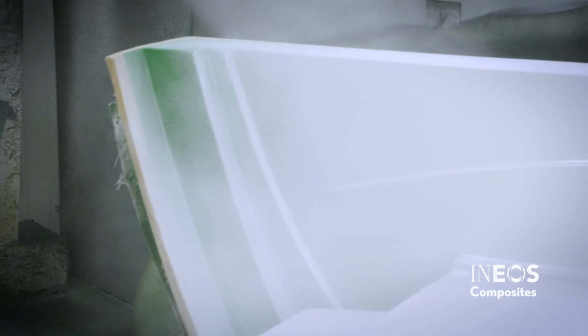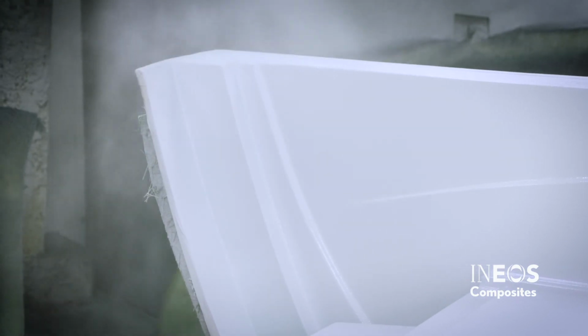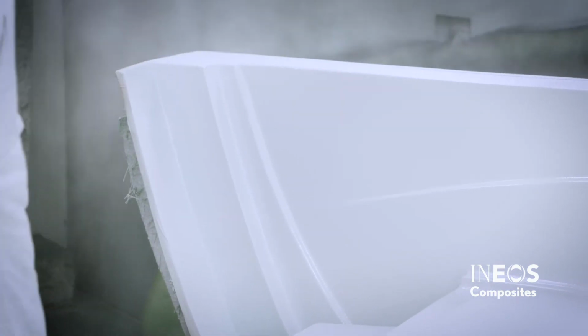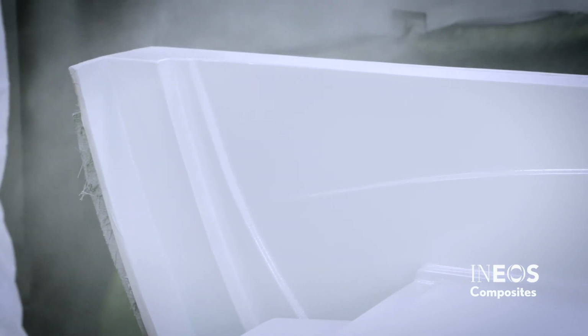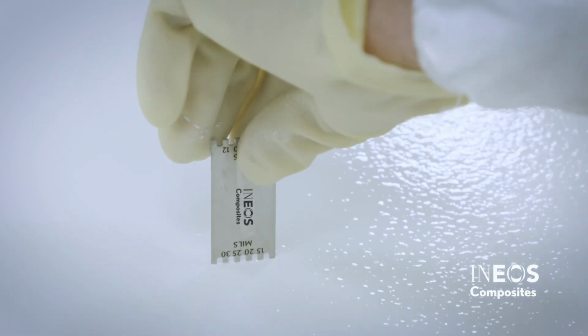To avoid thickness in the corners, spray down the corner in a single pass, then spray away from the corner area. For parts with deep channels, make sure the sides are sprayed in adequate thickness without spraying too much gel coat on the bottom of the channel. Test the spray thickness with a mil gauge frequently. To better manage the thickness, spray more slowly using 5 or 6 passes instead of 2 or 3.